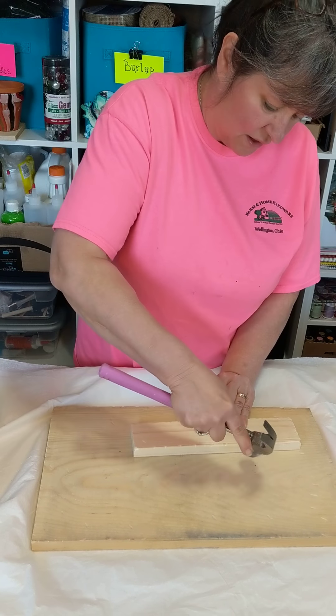Because I want this side where I'm going to put the wood glue to stay dry first, normally I'd do the back, but since we're in a hurry with the video, I'm going to do the front first. A couple of tips when doing anything engraved: really want to go around and work it into the engraved areas first because we want that to pull in and soak. The longer you leave this on, the darker it'll be. I'm going to put a really good amount in my engraving. You don't have to do the back, but I think it's a good idea, especially if you're giving it as a gift.